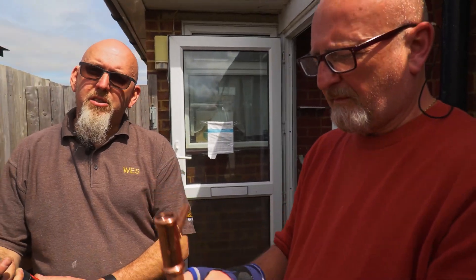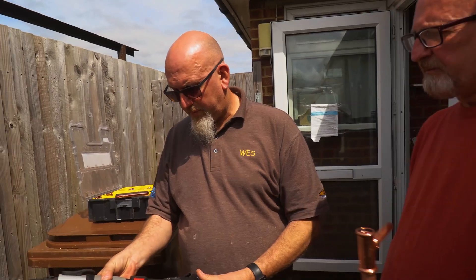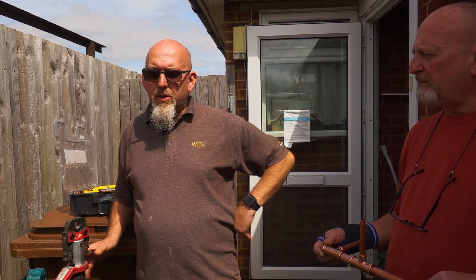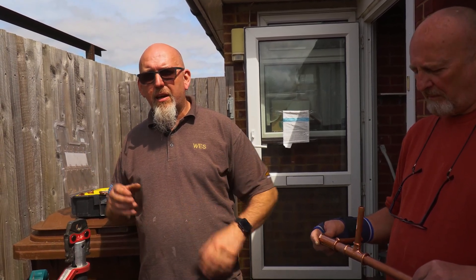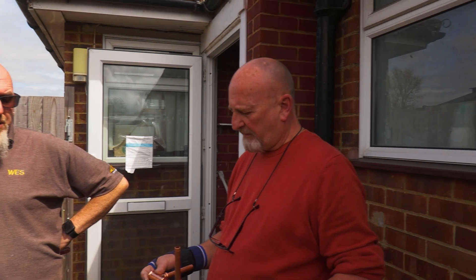Rothenberger has their own UK service agents for servicing. Jamie has gone about 95% press fit now — they work in hospitals where hot works aren't liked. For brazing big pipes on a roof they still need a blow lamp, but in hospitals press fit is ideal because you avoid setting off smoke alarms. In fact, hospital staff are quite happy when they turn up with a press tool — no hot works needed. The Zed press tool crimps just as well as the Rothenberger with no real difference in quality, and there are apparently even smaller models coming.